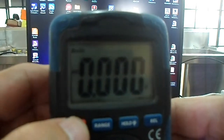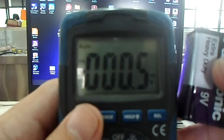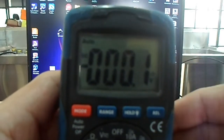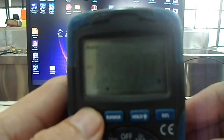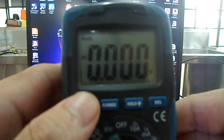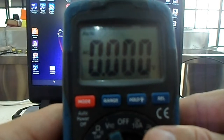So if you will measure the voltage of a dry cell or a battery, you will set the mode to DC. And if you want to measure the voltage of an AC outlet, then you will press this to change the mode to AC. That is the main function of the mode button. Next to it is the range button.